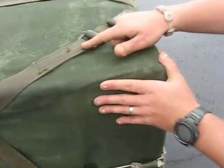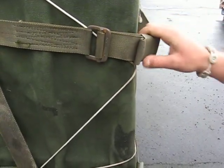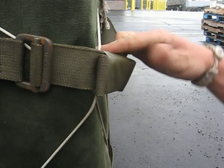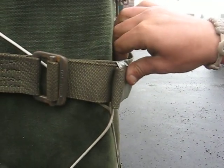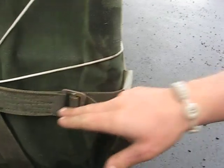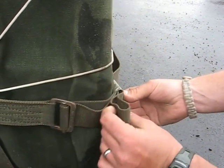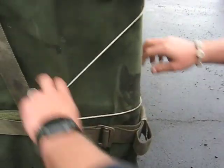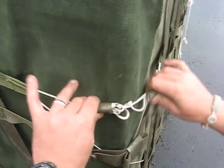At the second corner: upper strap — no twists, green, green, metal, green, excess taped and secured to itself. Middle strap — no twists, green, green, metal, green, excess taped and secured to itself. When checking these, run your hands behind the excess to make sure you've got the lacing cord on one side and the tape on the other, ensuring the tape is not routed around the lacing cord — that would be a deficiency. Lower strap — no twists, green, green, metal, green, excess taped and secured to itself. We're going to have to fix that. It is type 3 nylon: ground to sky, across to the middle, ground to sky, tied in a knot. Excess is taped and secured to itself.